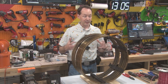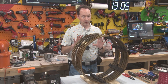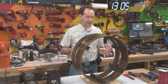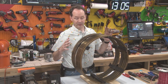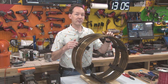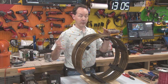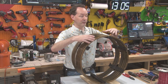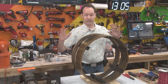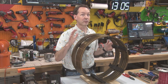What I'd like to do is completely tear them down and rebuild them from scratch, and we can do all but one part of that. For the new drive motor going in, we have drive control, but we're not doing positional feedback from the rotating shaft assembly. We can do it in other ways, and this allows us to get rid of five of these rings — just get all that weight out of there, makes life a lot easier. It also means five less brushes that we have to do maintenance on, which is really cool.